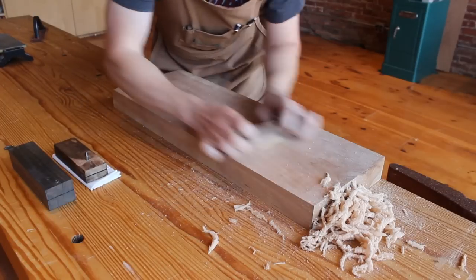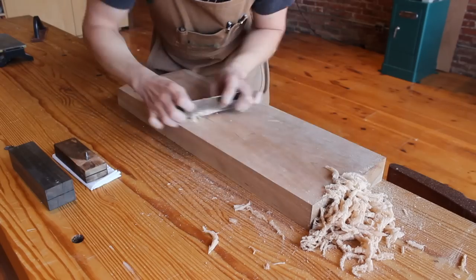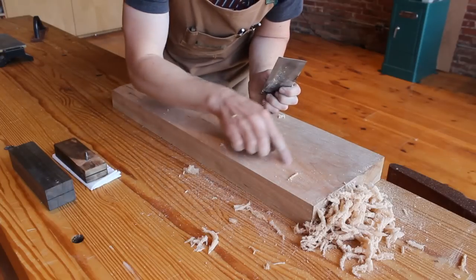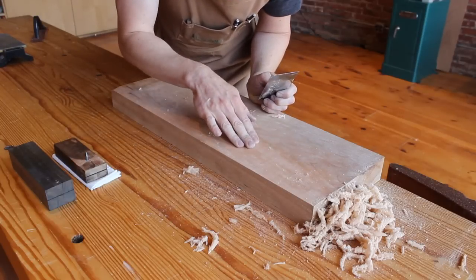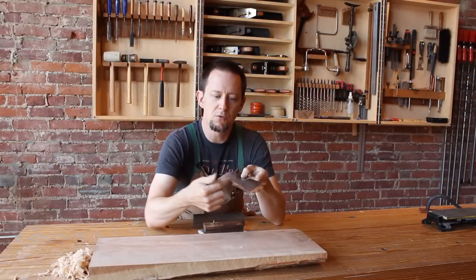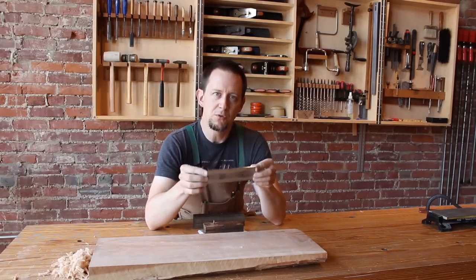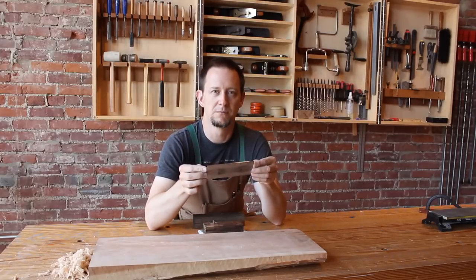So to sum up: you want to learn that flip technique to keep your fingers and your scraper from overheating. You want to be making shavings, not dust. And if you're removing tear out from the face of a board, remove it in a wide area so you don't create a depression in your board. If you're starting out with a new scraper, you're going to have a lot of work to do to polish these faces and get them ready for use. But I guarantee you, if you learn to sharpen a scraper properly, it will become one of the most valuable tools in your entire shop. Thanks again for watching — please subscribe if you like the videos, and check out danielchafin.com.